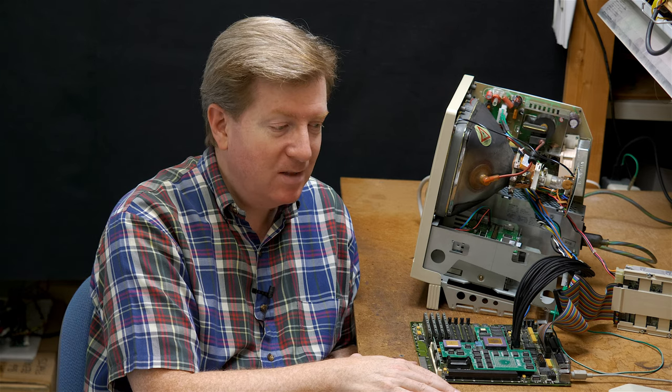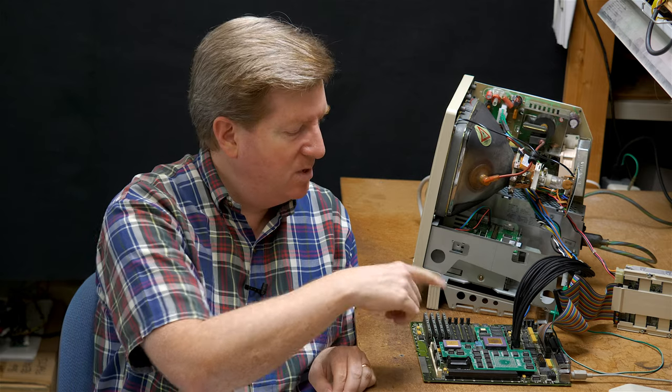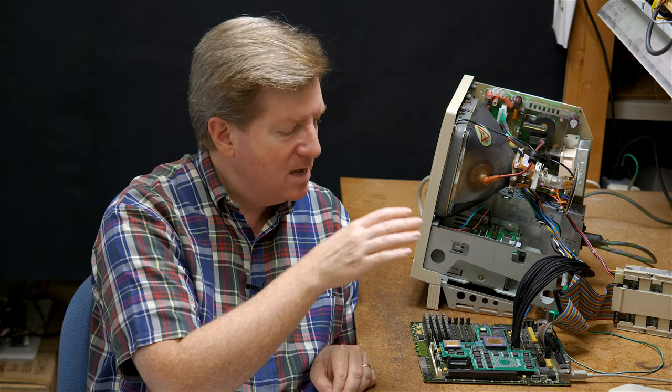If you use papers or something else, just make sure that the bottom side — the solder side — is protected. You don't want those little pointy feet to poke a hole through and connect to some kind of metal surface beneath. Just make sure you're working on an insulated surface and you'll be good to go. That's basically our video today. Hopefully this little tip will bring a benefit to you tinkerers, especially if you're doing voltage measurements, because running wires inside the chassis is dangerous — you might short out something. It's really best to do your tinkering with the board pulled out like this.